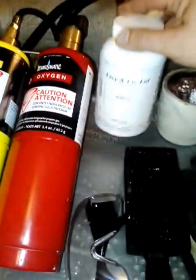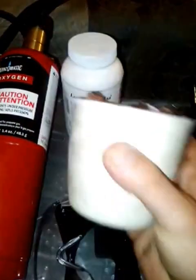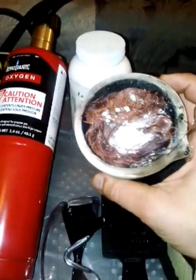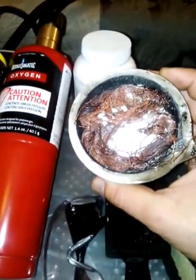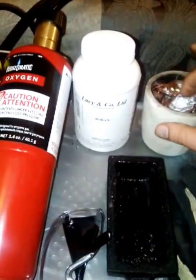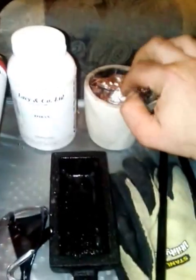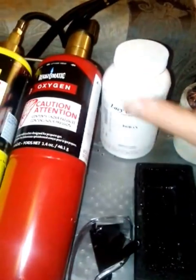There I picked up something called borax. Borax is something you put in the crucible — you can see this white stuff. This is a crucible, the container that holds the metal you're going to melt. I've put some copper in here with some borax inside, which prevents it from oxidizing and gets rid of impurities.